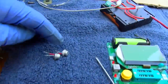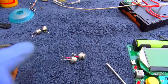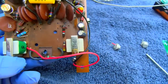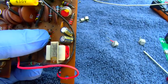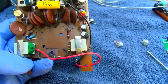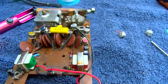All of these transistors are good, according to this. And yes, the pinout is the same on these as these. I'm looking at this and I'm struggling with what I'm seeing, and I might have to draw this out because these are connected base to emitter, and I don't understand this 10 ohm resistor. The whole thing is like just a big loop back to itself. I don't get it. This is where a schematic comes in handy. I can draw this.